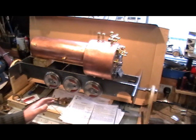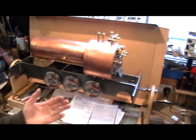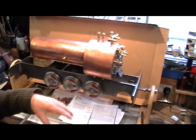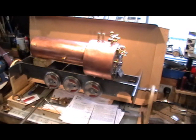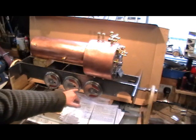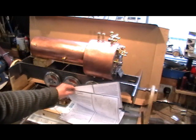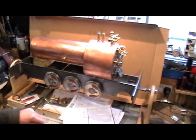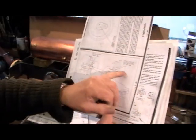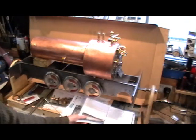I'm going to make a start on these parts now, but I'm not going to show them in great detail because it's basic turning, basic drilling, basic sawing, and basic filing. I'll perhaps just give you a flavour of them as I get through them. The only thing I will probably do a more detailed video on is when I set the return crank up with that jig — I'll show you how I've set that up. Also, I've got to quarter the wheels when I've got the crank pins done. I'm not going into detail with that now, but you do it on your lathe with some jigs set up — we'll get to that when we come to it.